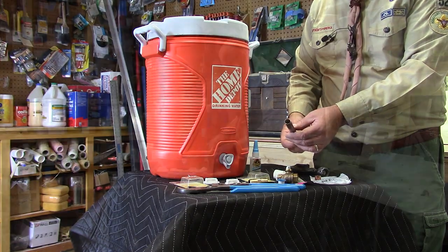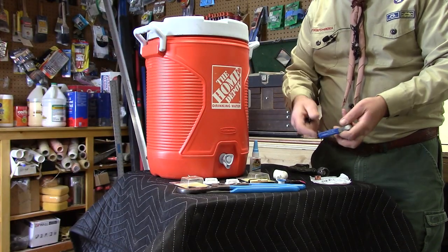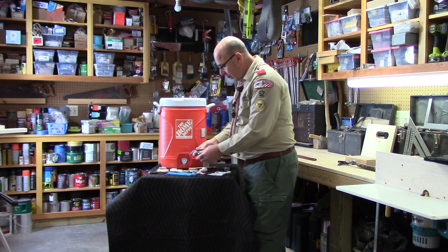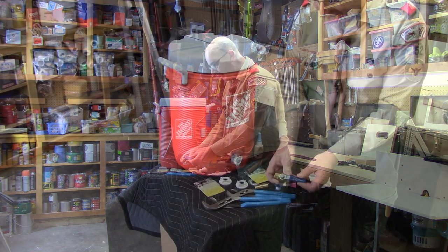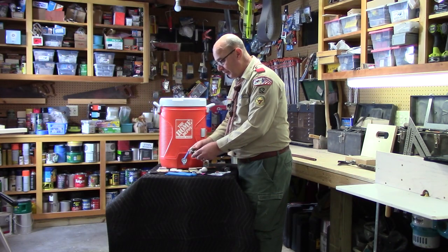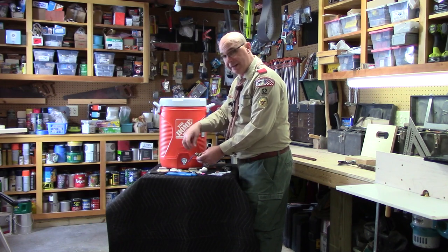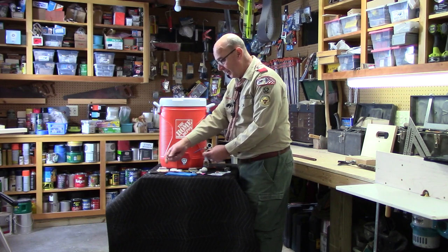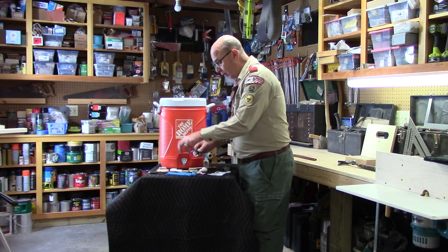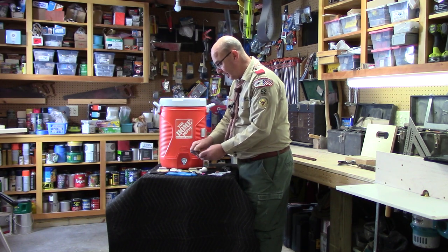The handle is nothing more than a seven-inch-long piece of half-inch plumbing conduit. I crushed down a portion just enough to fit over the rubber covering of the valve handle. The reason I use the ball valve is that it only requires a 90-degree pivot to fully open, versus a gate valve which takes several revolutions. With this extension, it's possible to operate with your elbow or forearm, so it's important that it turns on and off with just that 90-degree turn.